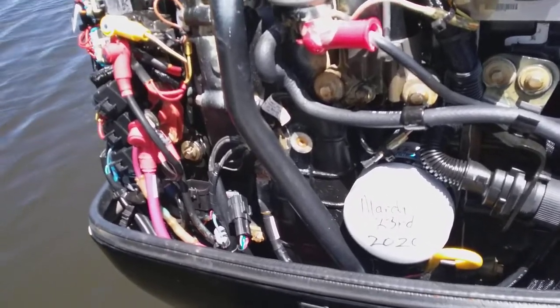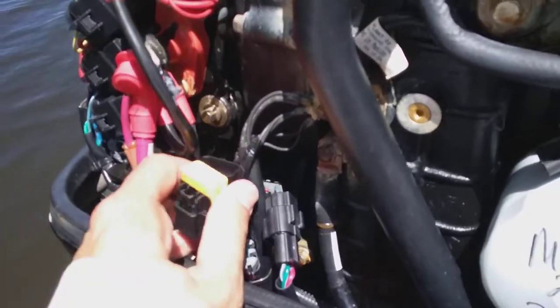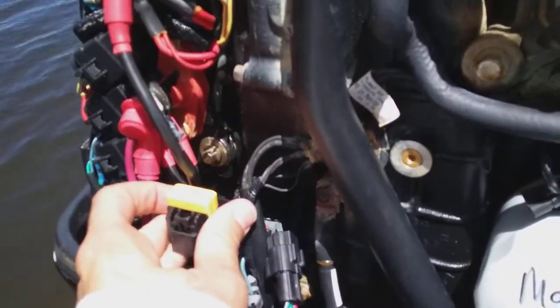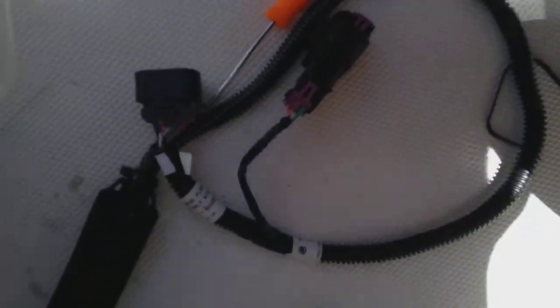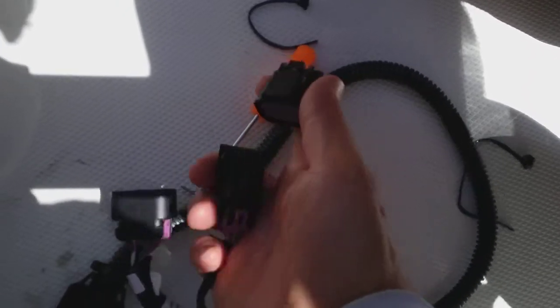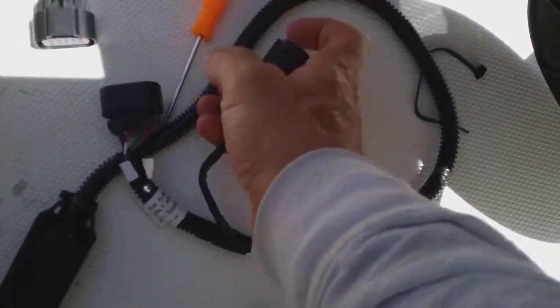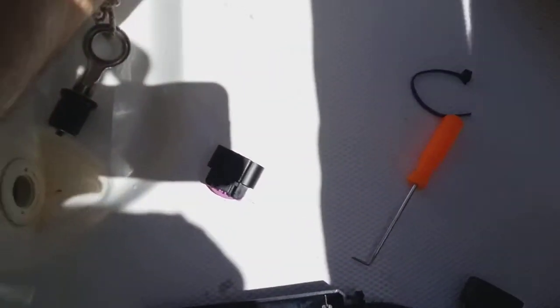So just real quickly, you've got to find this terminal. This yellow cap terminal is down on this fitting here. You take the yellow cap terminal off and you'll see your Vessel View harness here. It's real simple — you really can't mess it up. You're going to have this weather connector, the purple weather one, on your existing Vessel View. Here's the Vessel View unit, as you know. And you're going to put your yellow terminal back on here and snap it in — just for practice.